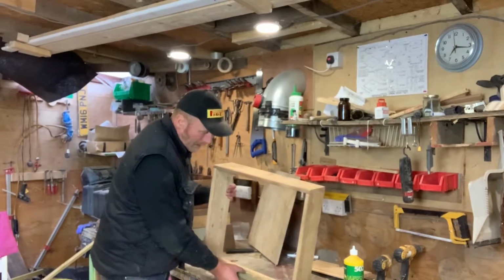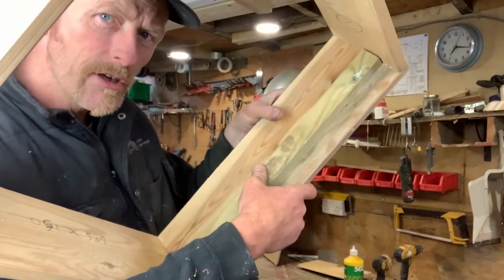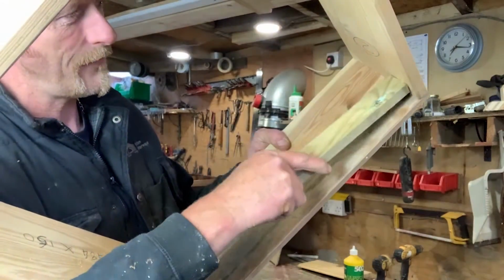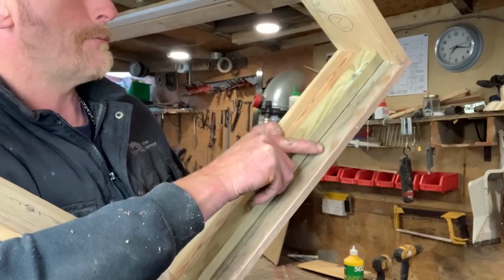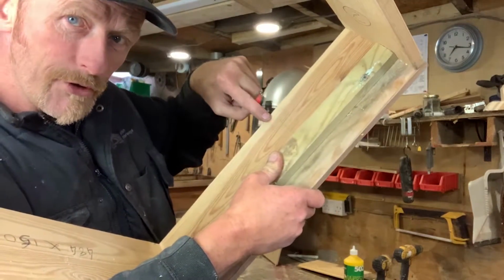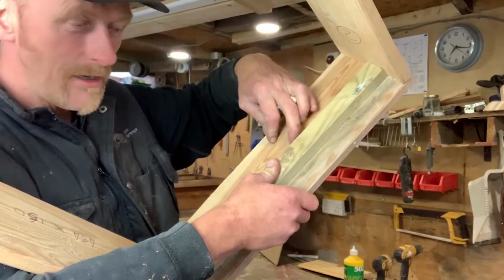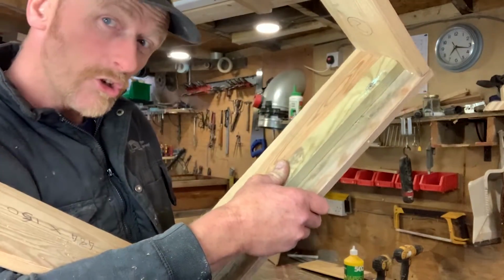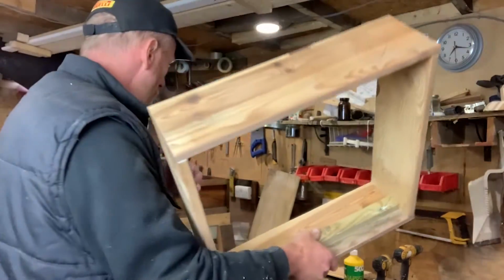Probably a 2mm gap there, you see, but that's all I'm going to do. Just going to get like that. Because I've got that hole there that I definitely want to cover, I'll probably sit it there, maybe right on the bottom of that hole, so it'll leave me that kind of gap on the top, maybe a 3-inch gap, inch of insulation. That gives me a little bit of a gap, and I'll put my air vent in that bit there. So I'll just frame that round and then I'll come back and show you what I'm going to do next.